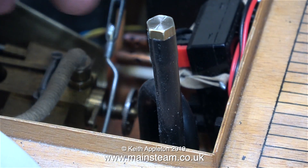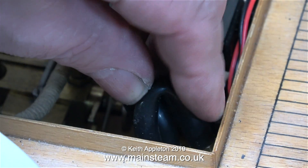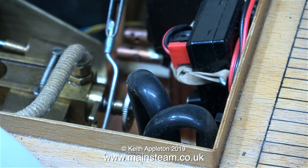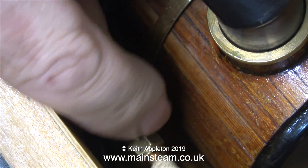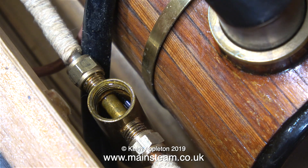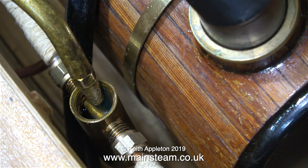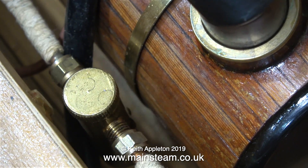Here's a close-up of the condenser oil trap drain pipe. The idea when it's running is I fold it upside down, and the pressure of the rubber tubing against the front part of the open hatch keeps the condenser away from the radio equipment, because the condenser just sits loosely on two bolts. Between the steam pipe from the boiler and the steam pipe to the engine is a displacement lubricator. I've removed its cap and I'm filling it with steam oil, then carefully refit the cap.